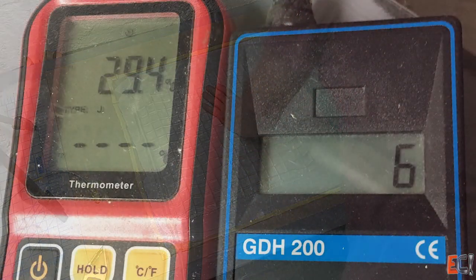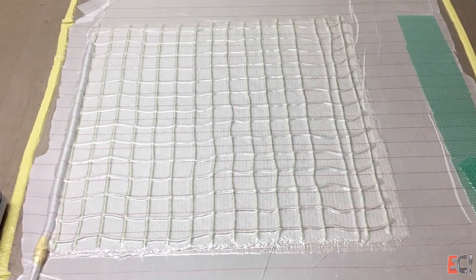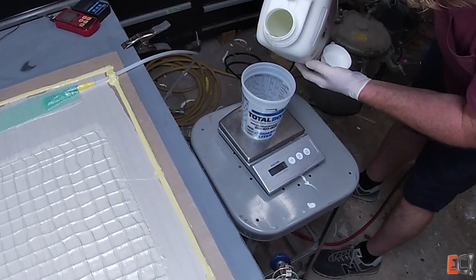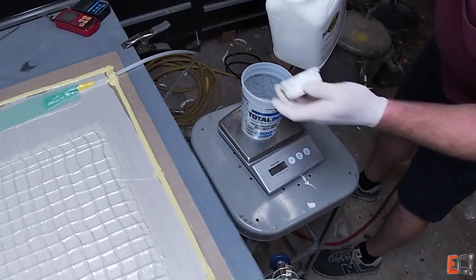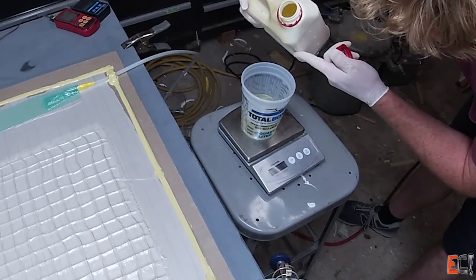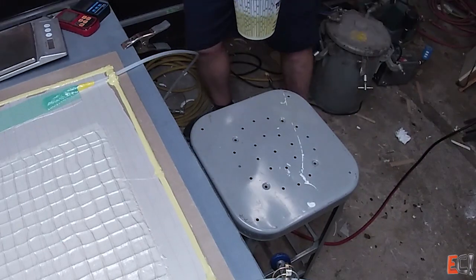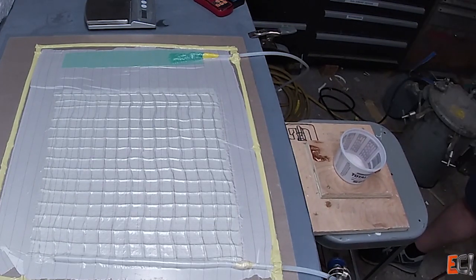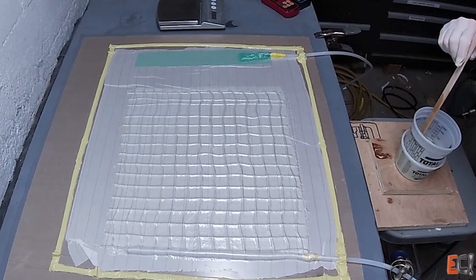About 30 degrees C for the table temperature and 6 millibar vacuum. You can see some crinkling and misalignment of the PowerRib. We're going to go with the resin — mixes just like a normal epoxy, with a mix ratio done by weight. Going to mix it up, scraping sides and the bottom to make sure there's no unmixed resin that gets sucked in.